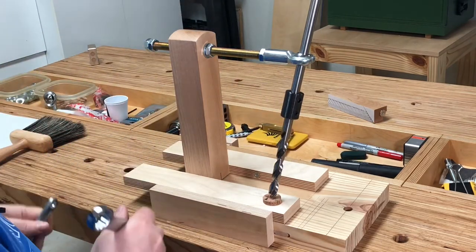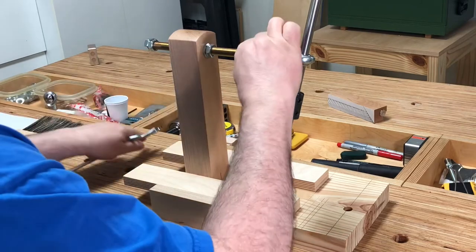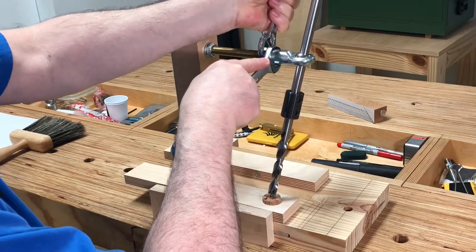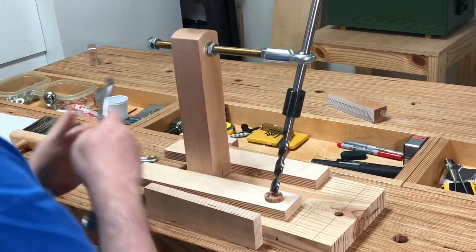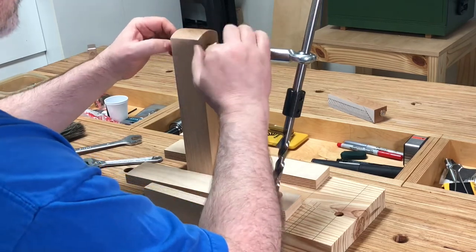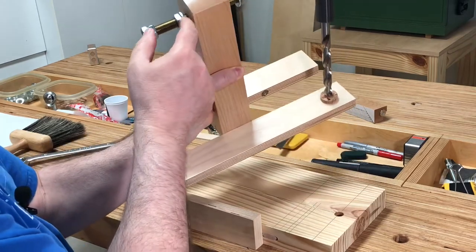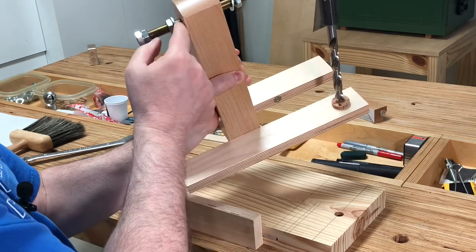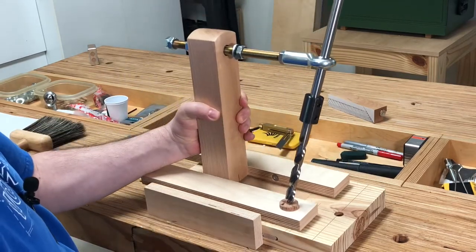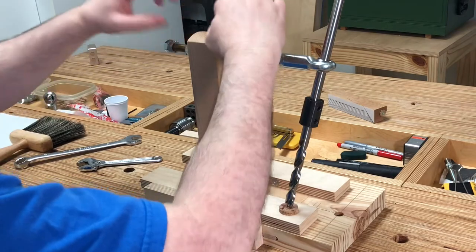There are some built-in calibrations already in the jig. Let me loosen up these jam nuts — and this one too — we'll need these loose when we do the calibration. If I move these back, you'll be able to see there's a little black mark here on the threads, and one on this side too. When I calibrate these, I go ahead and put these little black marks. These black marks do not go all the way around — just about halfway around — so you know which end is up.